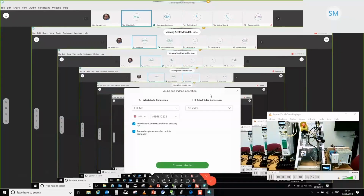When you're using dual loop, where would you actually set up the ratio between the position encoder and your feedback encoder? It's automatically done for you. You don't actually have to set it up at all. The only thing that you have to do is judge the resolution of the speed feedback encoder. So the output ratio in the AMC is always with respect to the normalized position in the AMC for that encoder interface, for the speed encoder interface.